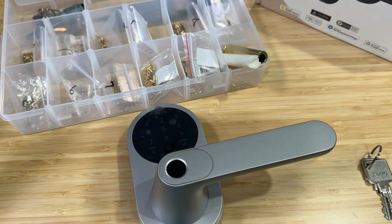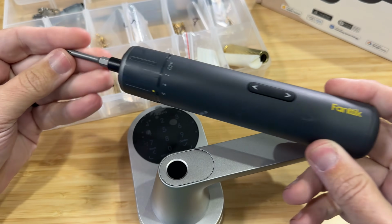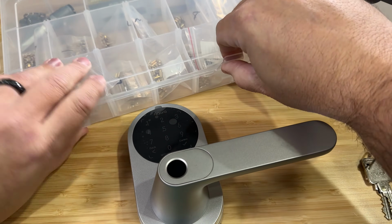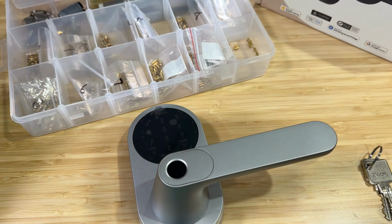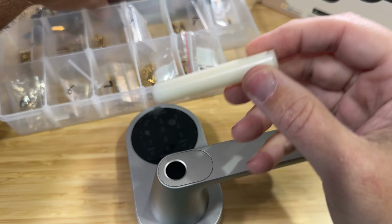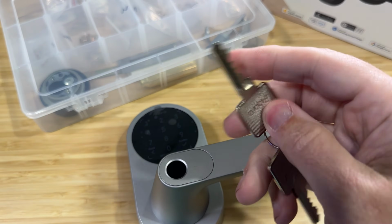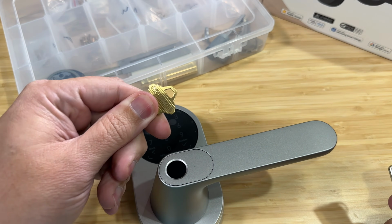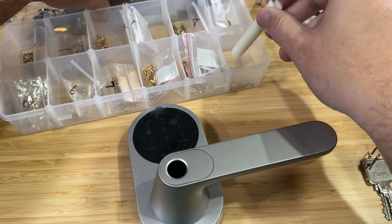All right, first you want to make sure you have the necessary tools. You'll need a Phillips head screwdriver. You'll need a rekey kit with pins, probably 0 through 9. You'll need a follower, which should come with your rekey kit. You're going to need the original key and the key that came with their core lock, so you're going to need 2 keys, and that's pretty much it.